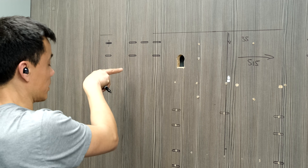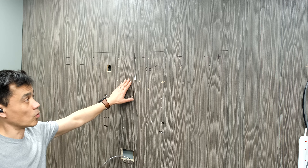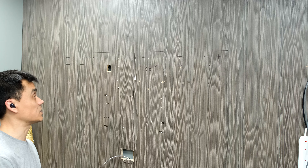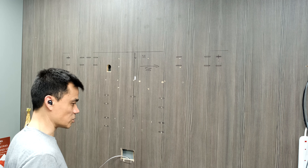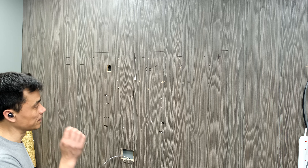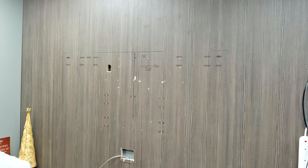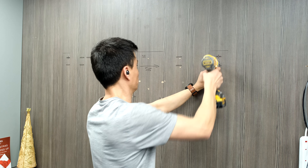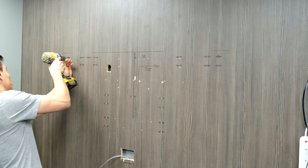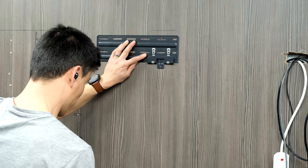I'll probably use about six fixings. It is important to use the appropriate fixings for your wall type. I've got a chipboard wall with studs so I can screw straight in. For brick walls the supplied fixings are actually decent — PH2 screw tip, plugs and screws work nicely. For dot-and-dab walls or breeze block, use concrete screws — drill straight in, no plug needed. For this wall I'm going to pre-drill and screw straight in with wood screws.